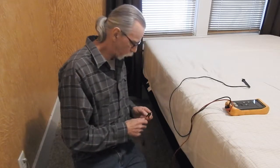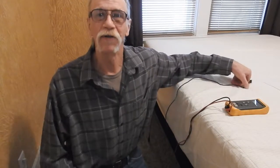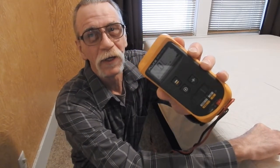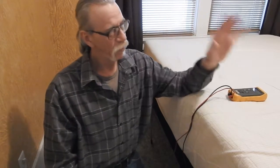So what we are going to do is hook an alligator clip onto this part of the meter and hook it onto the connector on the bed. I apologize for the quality of this video — maybe someday I'll have some of the stuff that the big boys and girls do. Let's do a continuity test between the connector in the bed and the silver fibers. We'll turn the meter on to continuity and just touch the sheet. Every time you come across a fiber, you're going to get continuity — kind of sounds like Morse code. That is how you check the continuity there. So now we know we have a solid connection from outside the house from the ground to this earthing sheet.